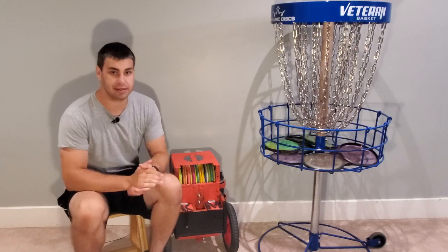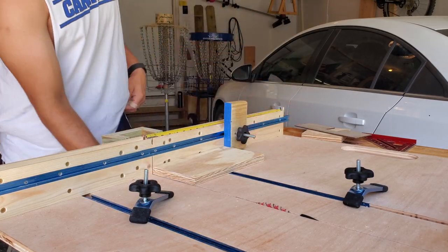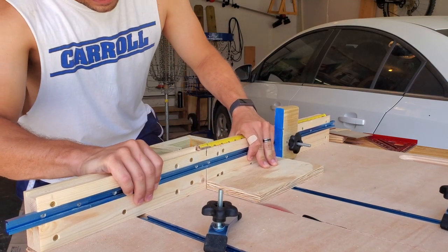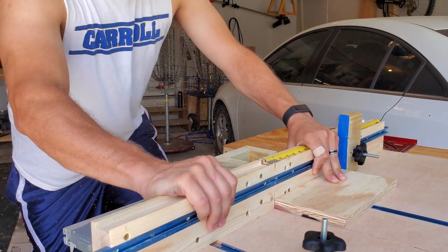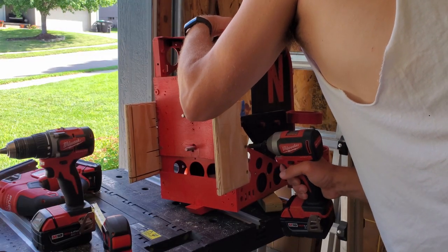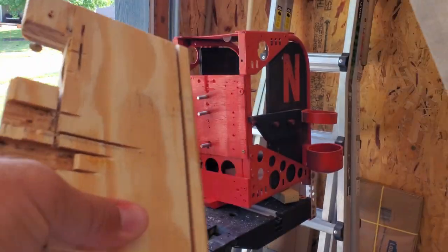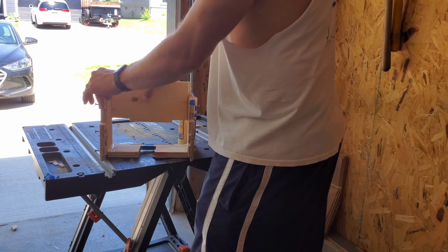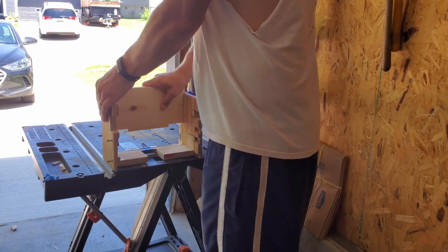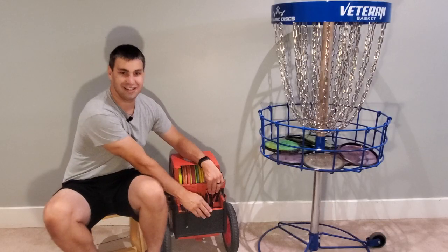Let me show you how I made this. I started out with some plywood on either side of my cart — about six inches of plywood with about an inch fixed into the side here, screwed in. I cut some slits on either side into the sides, making some sort of mortise cuts that slid the other pieces in, so this is incredibly strong. I also glued it up a little bit — hit this, it's not going anywhere.